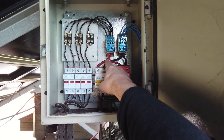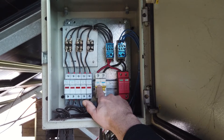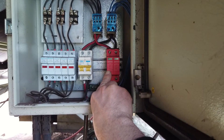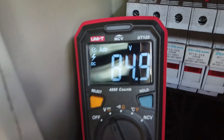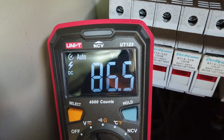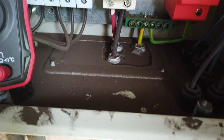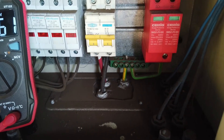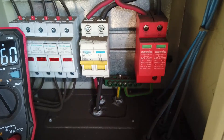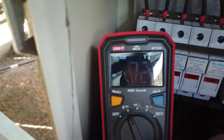The combined power and current goes into this breaker — it's a 40-amp C40 breaker — and here is the overvoltage protection. At the breaker I have around 85 volts. Let me measure: 85 volts. There's a six square millimeter cable going from here to the shed; the distance is around five or six meters, so six millimeter is fine, but four millimeter would not be okay — too much current for that cable size.